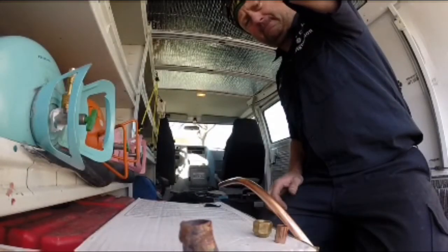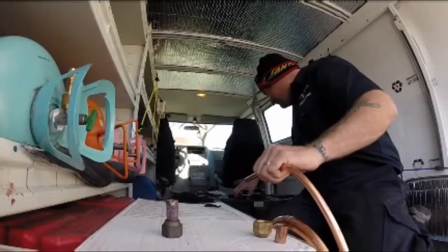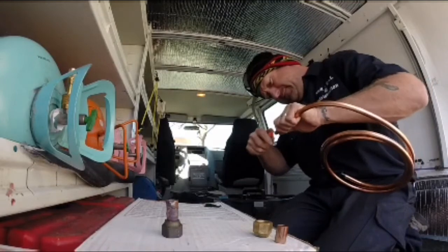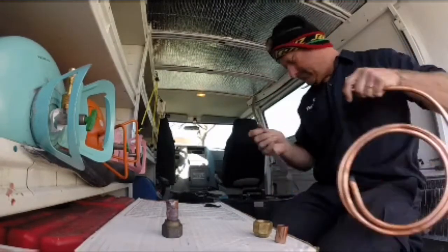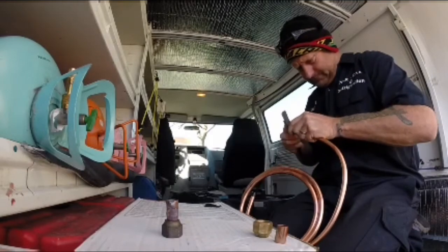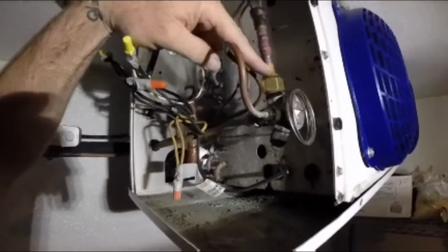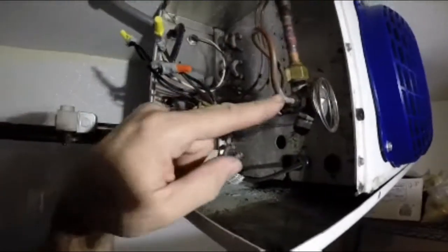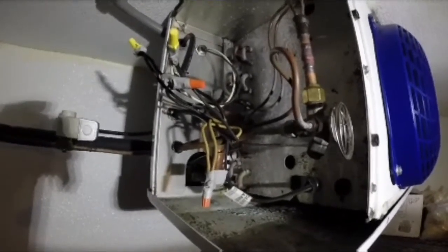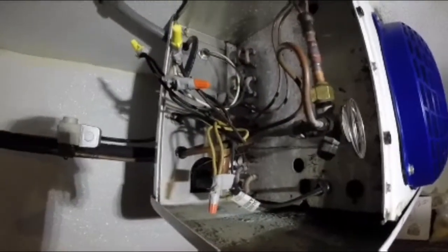I'm in the back of my van going to redo that little piece that goes on the TXV — I've got my copper here. We got the nozzle installed, remade this piece, new flare nut — we got it all back together and reassembled the TXV. Now we need to go outside and change our liquid line filter dryer, then we'll nitrogenize the system and check all our work for leaks to make sure we're tight, and then we'll be ready to pull a vacuum.